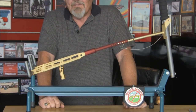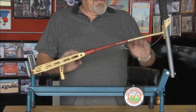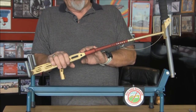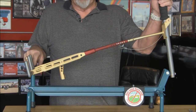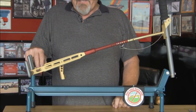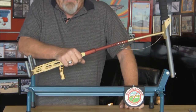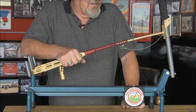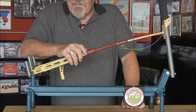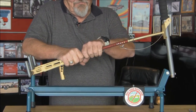We'll go back and stick this in the airplane and walk around to test the theory — grab hold of the controls and demonstrate how much they move or don't move. That's the principle it works on: it uses this chromoly tube and this T6 tube as a spring. That spring preloads everything — the rudder pedals, the ailerons, the elevator stick — and pretty much holds everything in place. You only need this one part; you don't need a whole bunch of other junk, two by fours with carpet on them, ready bolt and wing nuts. The RV is such a clean, sanitary little airplane that this is warranted.